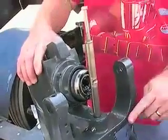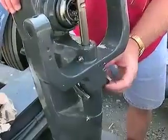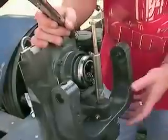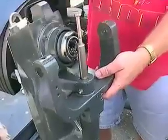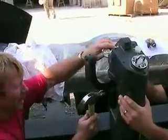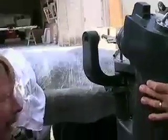Now insert the vertical pin so that the cutout in the pin will be facing the mounting plate on the stern. You may have to lightly tap the pin down into position. With the vertical pin in place, insert the horizontal lock claw pin and lightly tap into place. Don't forget to split the cotter pin to retain the claw.